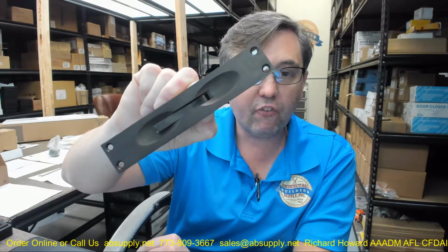But you're going to see these in older hollow metal doors. I'm thinking 1970s is really where I see these. So when I'm doing flush bolts indoors, they're generally older doors where the client has said, these doors were put in 1977, it's time for a replacement, they've thoroughly rusted through. When you replace these, you're probably going to use the 1-inch wide, only because they're so incredibly common, far more typical.